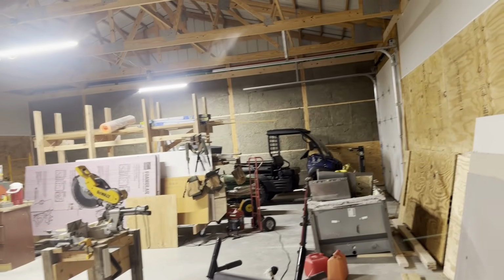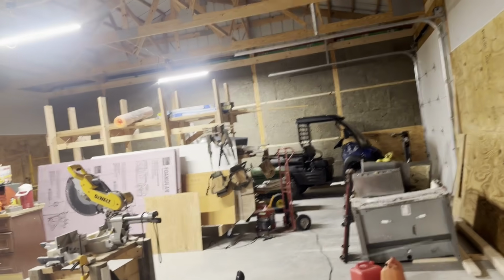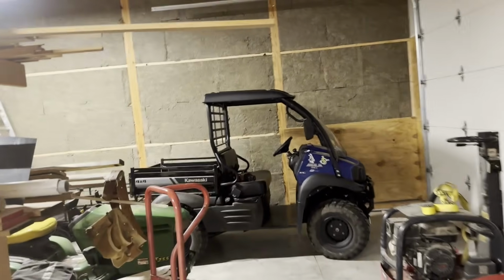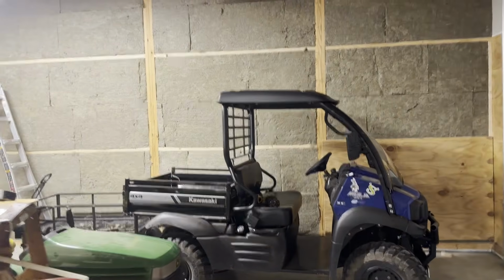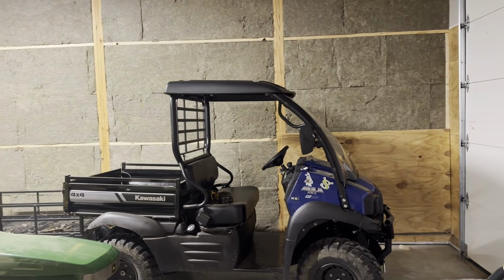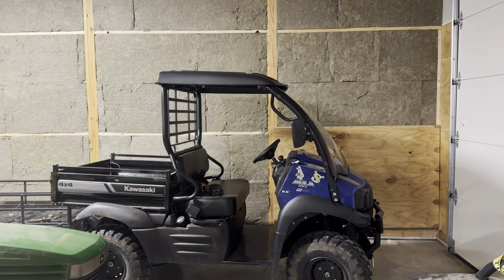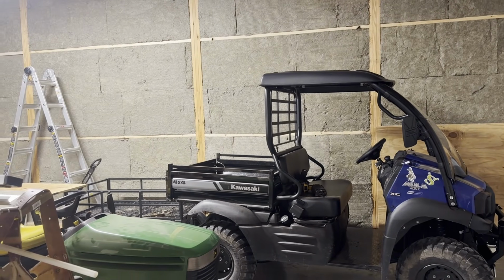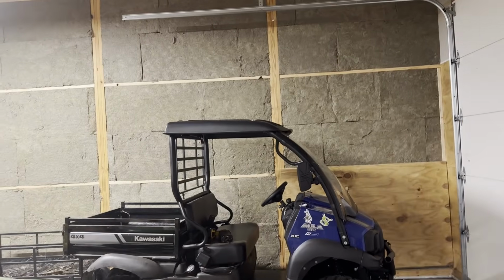All right, let's get these toys or tools, I guess it depends on how you look at them. Get these machines moved out of here. This morning we'll be putting plywood on the lower course, so all the way down through there. We'll get it put in level on the first pass. We'll scribe the bottom and then do the permanent installation, and then jump up top and get the panels put up here.